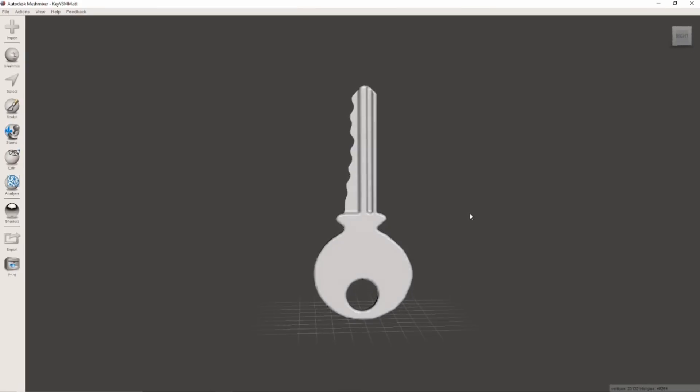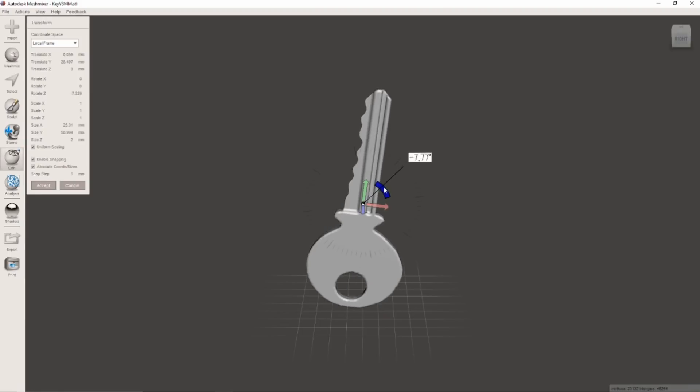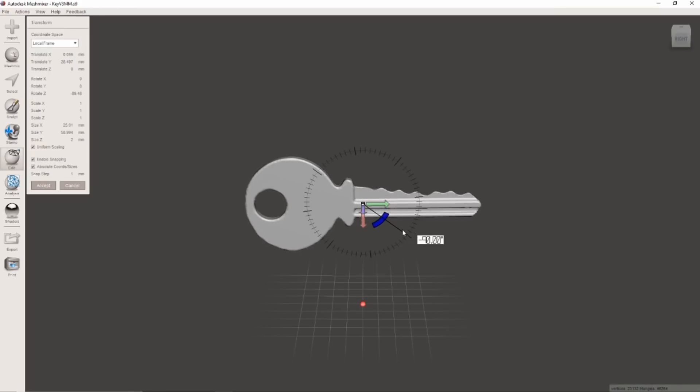That's when I realized the mistake I had made with the CR10S. With all my previous prints, I had printed it in a vertical orientation. The problem is that the most accuracy I need on this model should be going through the grooves and teeth of the key. Most FDM printers are most accurate on the Z-axis because that's typically driven by a lead screw, whereas the X and Y are driven with belts. By orientating it horizontally and adding supports below, I'm going to get much more accuracy going up through the grooves and teeth of the key. So I went ahead and sliced it that way.